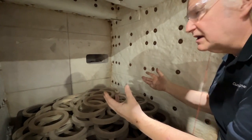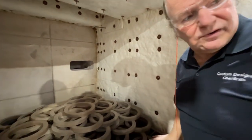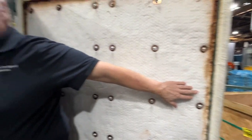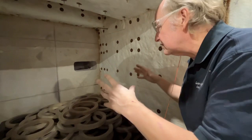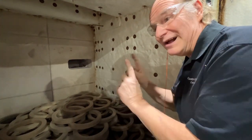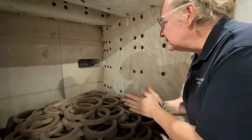In the process chamber, we are starved of air, so there's no way that air can get into any cracks. There's a door gasket on the door over here that prevents air from getting into the oven. It's very important not to have any holes in the oven and not to have any source of air. If your oven is really burning well, you also do not want to open the door, because then you add oxygen to the process chamber and you might actually cause a fire.